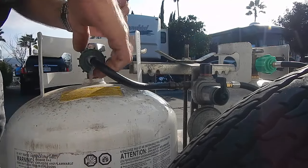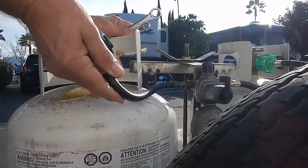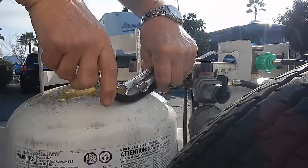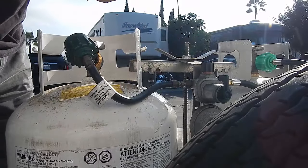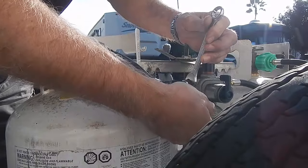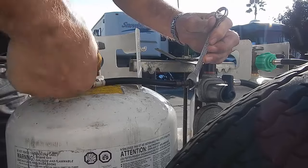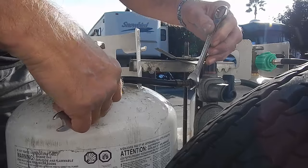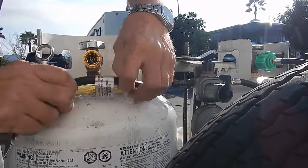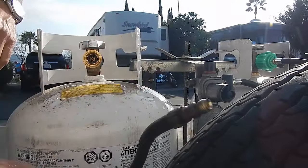Camera angle isn't great over here — sorry, trying to keep the sun out of the lens. Same drill over here, and notice the movement — that's what taxed the old stiff hose and got it leaking when the bottles were replaced. Keeping our adapter in place, loosen up the quarter-inch pipe thread. I could remove the propane bottle if it was that much of a hassle, but in this case I think I can deal with it by leaving the bottles in place. There we go — got the old one off.